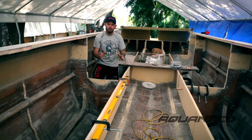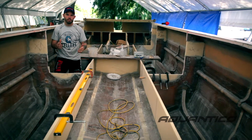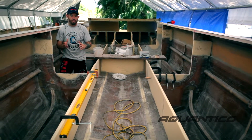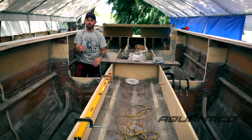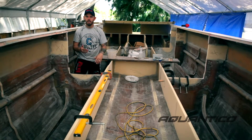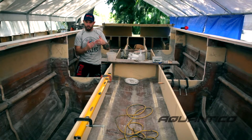A lot of companies, they love rub rails. Rub rails on the outside — okay, if you need a rub rail because you don't want to scuff up your boat, or you could use a bumper or whatever it is, that's fine. But that should be an accessory, something that goes on afterwards, not where you're hiding where the hull and the deck join together. That's ridiculous. If you have a weak spot there and you hit something big enough, you're going to have a pop there.